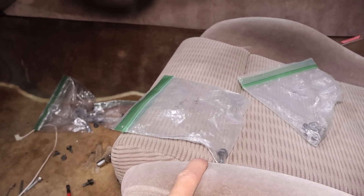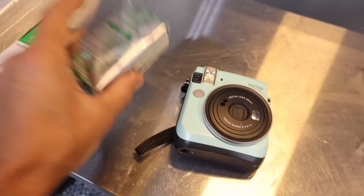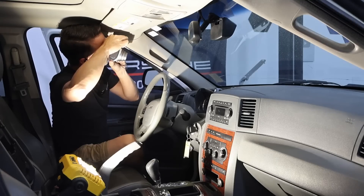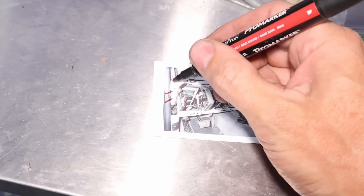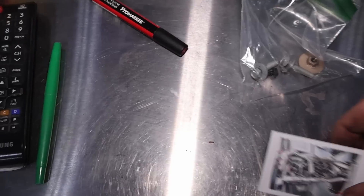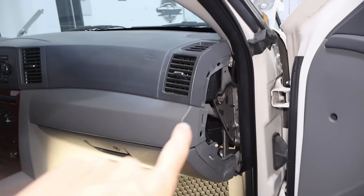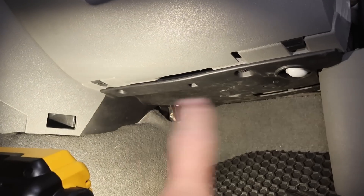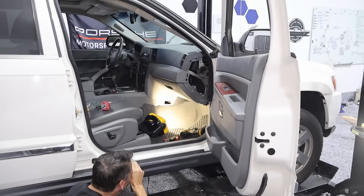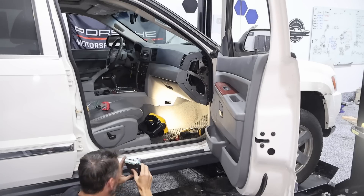So I've got a new method I'm trying. The big secret — I'm stealing my daughter's Polaroid camera. I bought some film, and what I'm going to do is take a picture of each place of assembly and actually put arrows to where the fasteners were. That way I'll put the picture in with the fasteners. So when I take it out, I can just look at the picture and know exactly where things go. My first few fasteners — I've got two right here and similar fasteners right there and there. I'm going to take a picture, get both in the same frame, then draw little arrows to where they go.